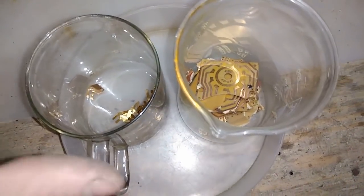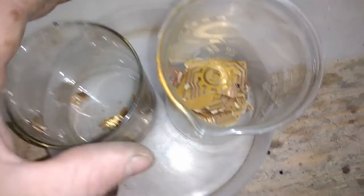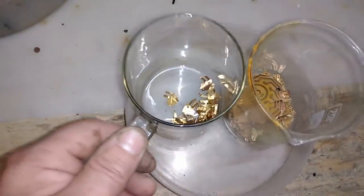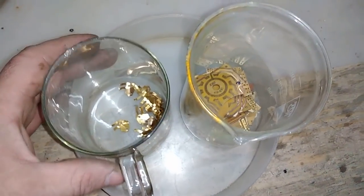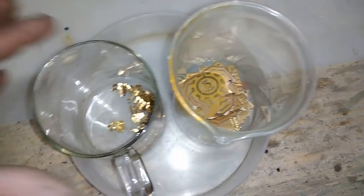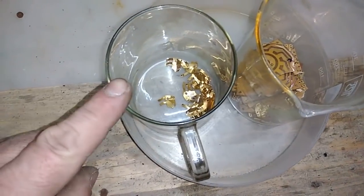Okay guys, I'm done. All 15 pieces are in the beakers now. I'll do that separately. This beaker has only the circles and the fingers on the boards — see that? And this little beaker has only the contacts and the metal pieces. It's copper — see the one in the middle, it's got a reddish color. So it's copper. I'm going to add diluted nitric acid now — 50% nitric acid, 50% distilled water — and wait until everything is dissolved. That will leave only the gold contact and the foil.